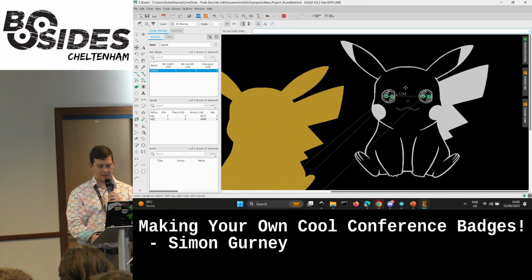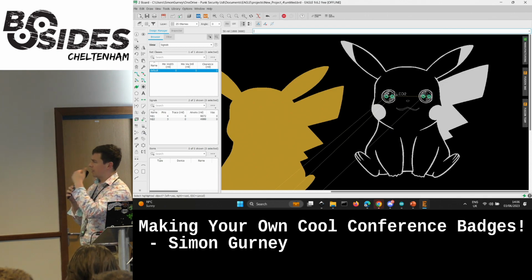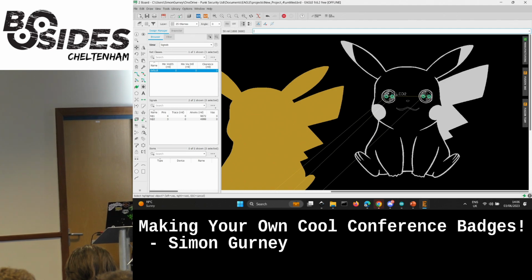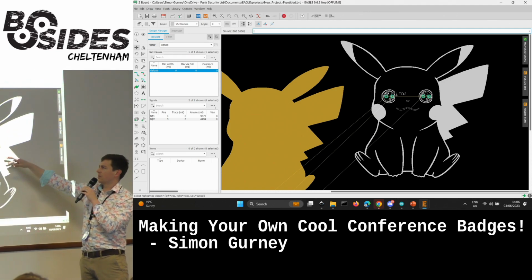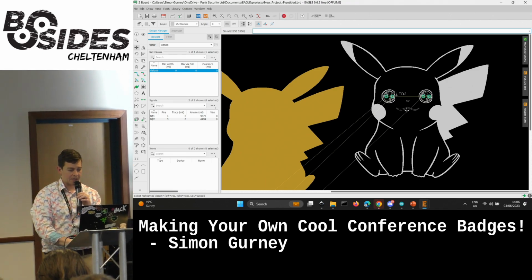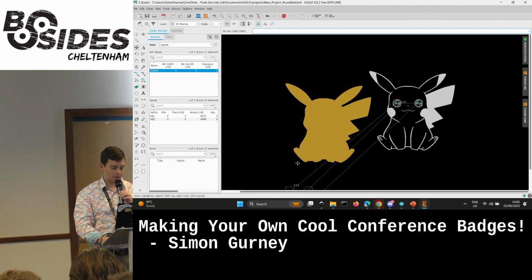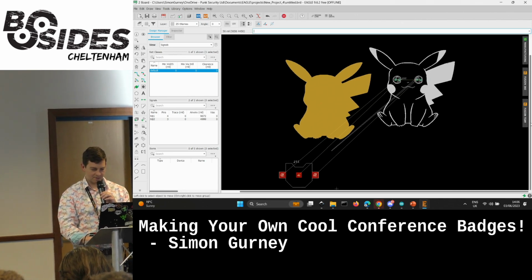So if we look at these a second, we've got the place things. We've got a bit of silk screen there, so you know where to put the LED. This will get printed to the board. That's why sometimes I put the silk screen I want on a different layer, because I don't want this nonsense on the board. So you don't want to put it on the same layer. And then you've got the two green circles. That's the holes for the LED legs to go through. And then the last thing is to... Oh, that's a bit of Pikachu's face, I think. Oh, it's got a massive eye thing going on.